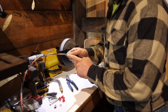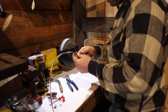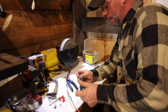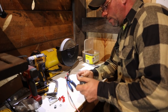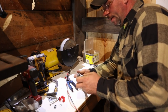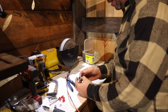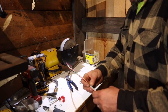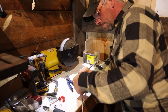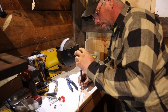Never forget your anti-short bushings — 'Annie shorts' — when you're working with MC cable and BX cable. Very important. You get a sharp metal edge there that can cut right into that wire and ruin your whole day. My allergies are kicking my ass tonight, so I'm having trouble talking and breathing. I don't like to run, especially around workbench areas, just Romex wire. In a blacksmith shop you might have the errant spark here and there. In most places it is code to have metal clad wire or wire in conduit if it is going to be exposed.